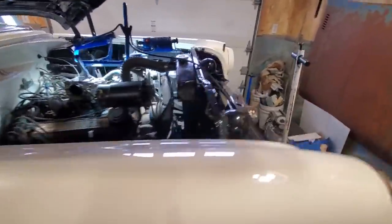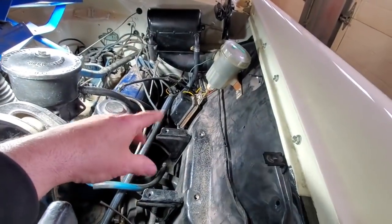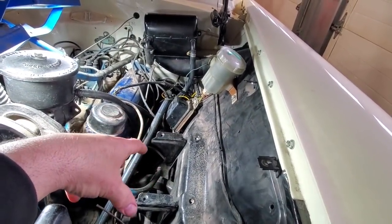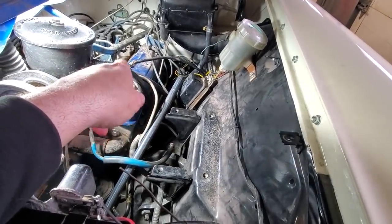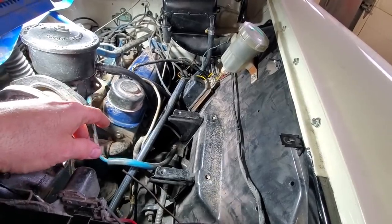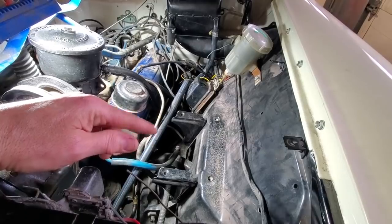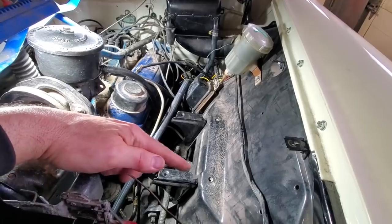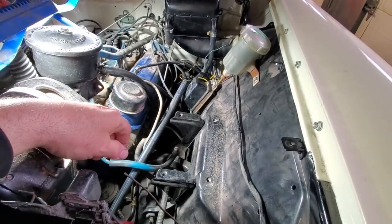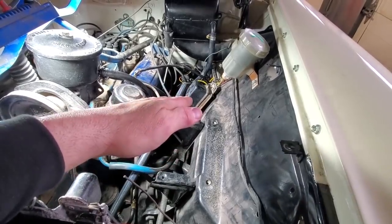And the hurdle that I got to do with this here today is it has no battery box. Now I looked it up online trying to find battery boxes for these, and the problem with the 50s cars, each Pontiac had its own pieces and parts. And I thought about just getting a generic battery tray and putting it in there. And I said to myself, I've run into that before, because where this mounts here in them 4 holes, the problem you're going to have is that it'll be a high spot there and a low spot here, and then it'll all be stood like this on the corner and everything.